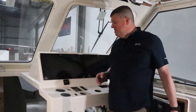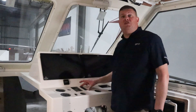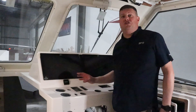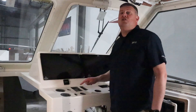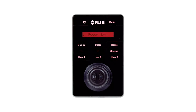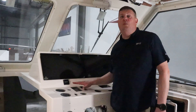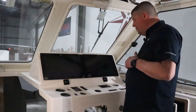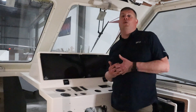Some of the other holes in the helm will house an RMK10 keypad. While these are touch screen displays, this optional keypad control unit provides physical buttons, a rotary controller, and a track pad — so when the seas are rough or you don't want to use the touchscreen, you can control the whole system from the RMK10. There's also a larger hole for the FLIR joystick controller, which provides precision control of the M364C thermal camera on the hardtop and direct access to camera menus. And this is a Yamaha Helm Master equipped boat, so there will be a Helm Master joystick near the throttles, with the engines tied into the Axiom XL system as well.